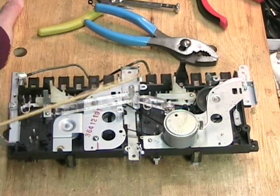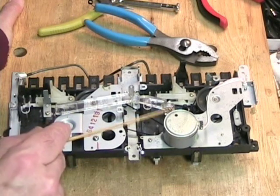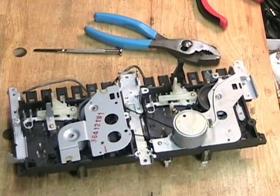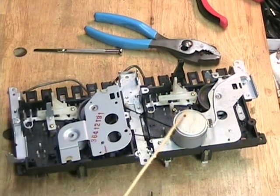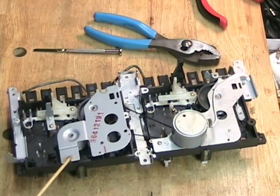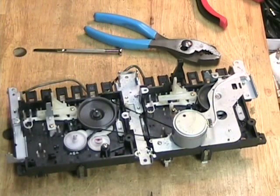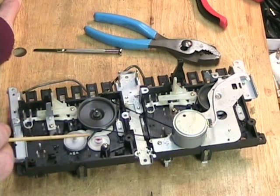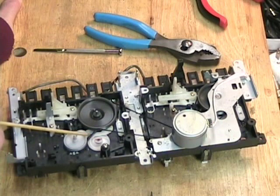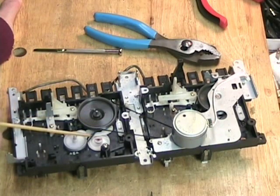This clear plastic piece is for the record-play switch and comes out by removing one screw. I'm going to do that because I need to replace all the belts — they're very loose. To change the belts I have to remove the capstan thrust plate and also the motor side, which is held by a screw through this hole and also has two plastic locking tabs, so it's a little tricky to get out. Once it comes off, it reveals all the belts. Here's the capstan belt, and here is the secondary belt that drives the fast-forward/rewind idler, along with a bunch of little gears for transferring the motion. I have to remove the upper belt first, then I can remove the lower belt and replace them.